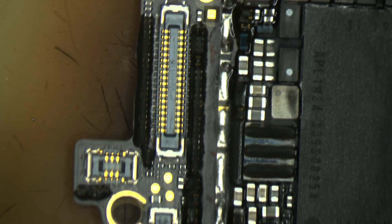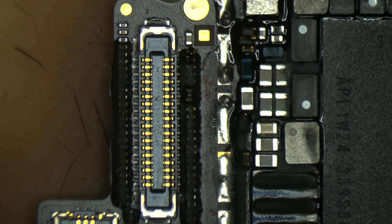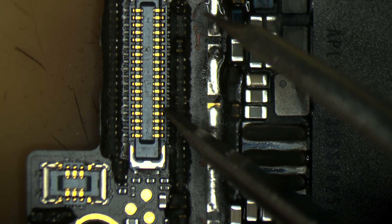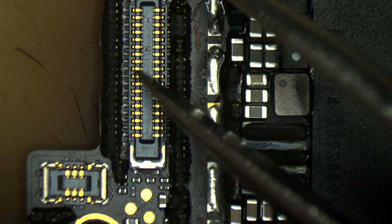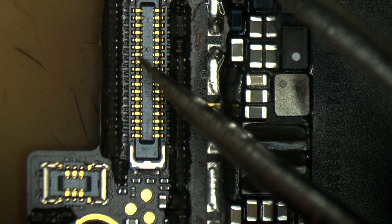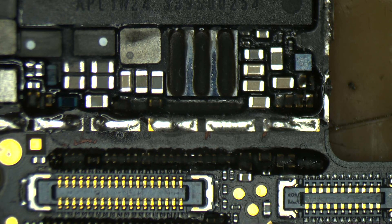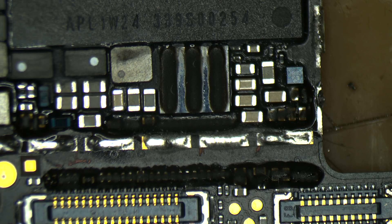The second thing: this is a very common problem after fixing an audio codec issue — everything appears to work but the upper speaker does not. You have to check the front camera flex, try another one, and check the forehead flex connector on the board for anything missing or damaged, especially if there was water damage. You can download all the schematics — I already made a video on my channel covering schematics for all iPhones up to iPhone XS; I'll put the link in the description.